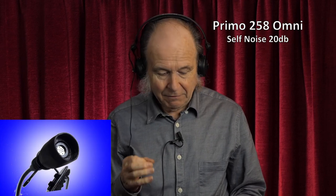There wasn't a microphone casing for this — you can put it in the larger casing which the 10mm one goes in and there's a rubber bush to hold it in there. What I did was get a 3.5mm jack plug, take away the plug part, and use the shell to mount the microphone in the top. I cut it in half to make it smaller, but then found that the sound was perhaps a little bit too thick, so I put a collar around it made from a piece of heat shrink tubing.